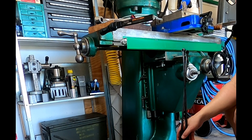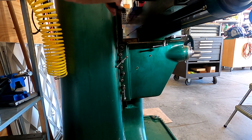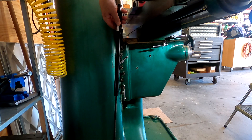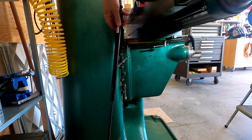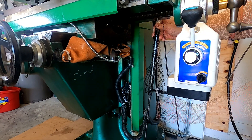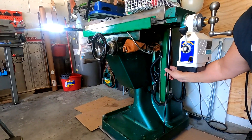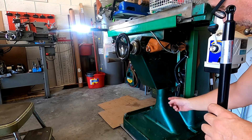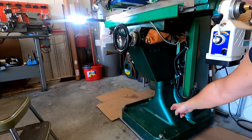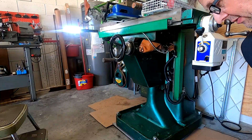Where to mount them? On automated equipment you typically see these cylinders mounted right close to the dovetail, but on one side I have the gibs which would make it awkward, and on the other side I have the DRO scales which creates issues. So I decided to move them out and put them straight down. Originally I thought to put them in line with the screw, but at the bottom there's a taper-out effect, so we'll move them right out here underneath where the load is almost all the time.